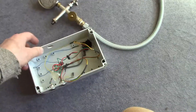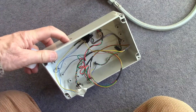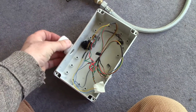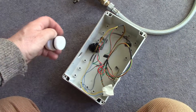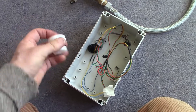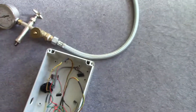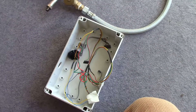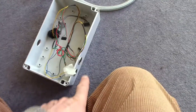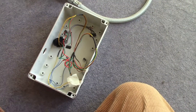What I'm going to do now is that I've removed this black plastic socket from here, leaving an 18mm hole. I'm going to make another Delrin thing which will fit in there with an O-ring on it and a nut on the inside. Then I'll be able to screw this manifold into it, and we can pressurize the box - either positive or negative - put it under water and see what happens. See if any water comes out of these things. Back to the lathe to do that.